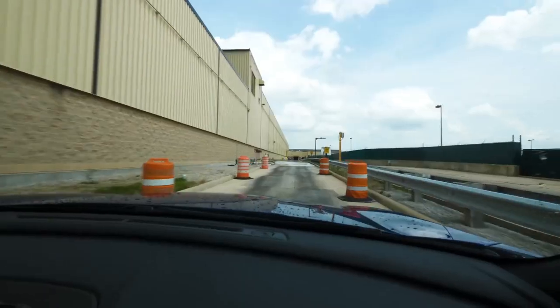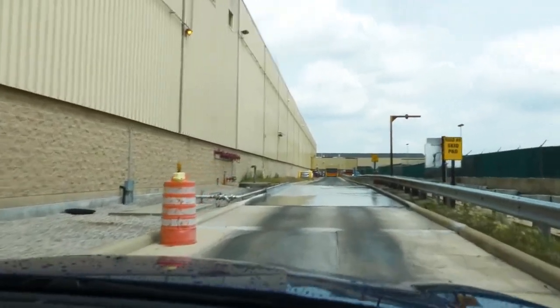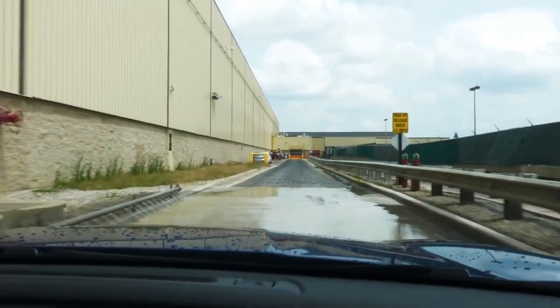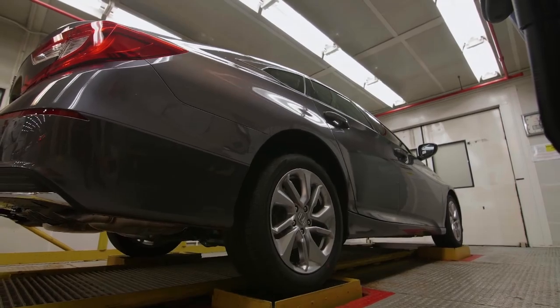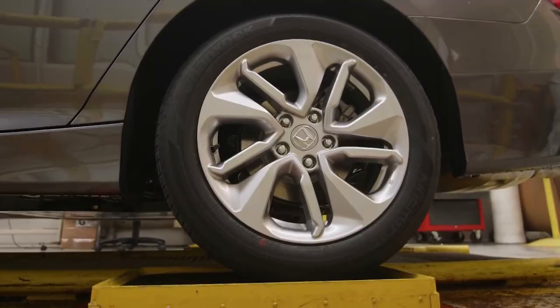Also while we're outside, we go down a squeak and rattle track. It's specifically designed to bring out different rattles in our cars — suspension rattles, interior cabin rattles, anything that the driver might come across. This is what's called body twist. We have a booth that's designed to recreate that track and allow us to find the noise. And then of course it's always a matter of checking the 10 cars before that car and the 10 cars behind that car, so we can guarantee our quality.